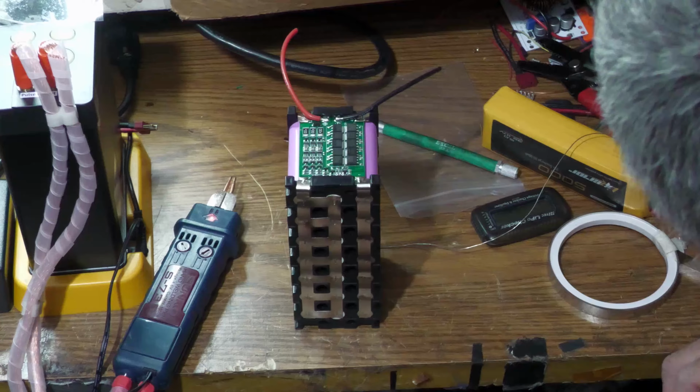and so all the negatives right here go to this first port, which has a 0V on it. So that's the negative. So you'll have one strip come up here and touch that, and so that's the very last or first of the cells, and that means that these two all need to be put together. So you put these together and you have it come over the end and go here, which is 4.2 volts. So basically that's measuring 0 to 4.2. So this is your first string.